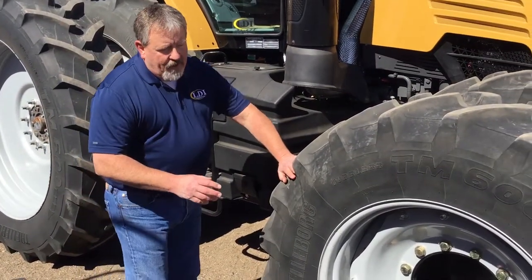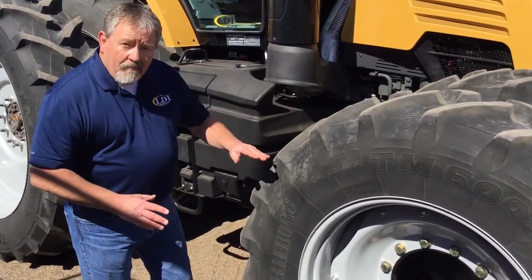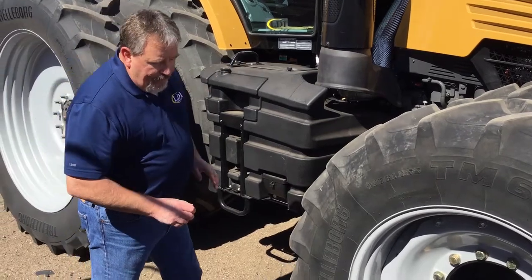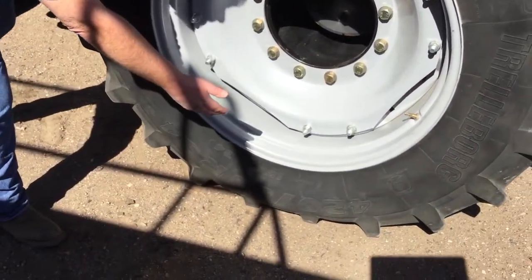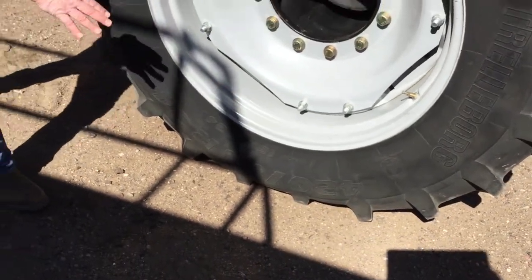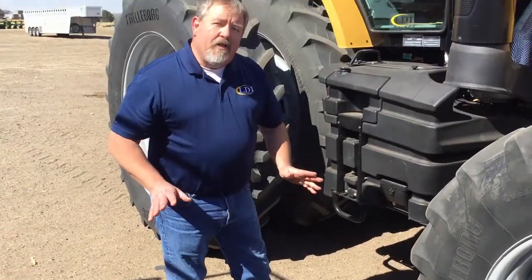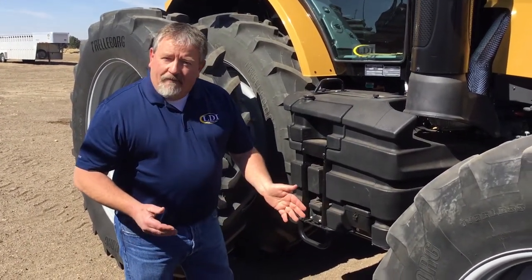To do that, we've got to go in and get our air pressure set properly from tire to tire. Also on the back, the proper inflation will basically put three bars on the ground, solid on the ground. That will be what you look for, and then you can adjust from that by whatever piece of equipment you've got on the back of the tractor.